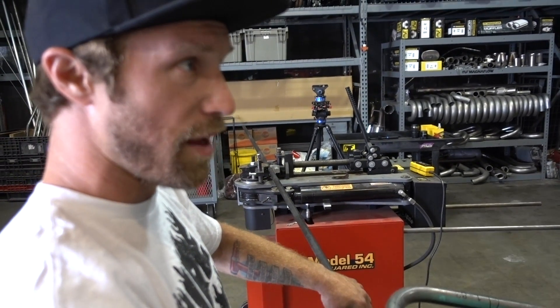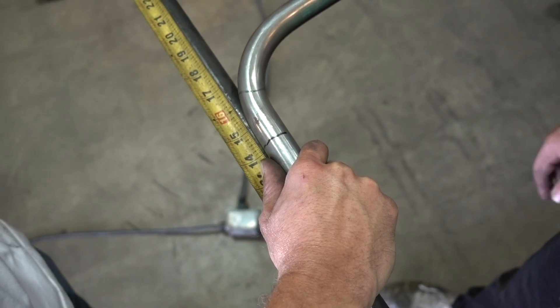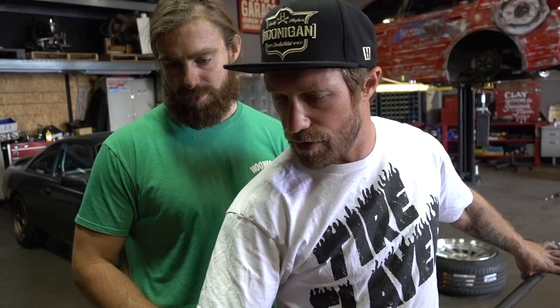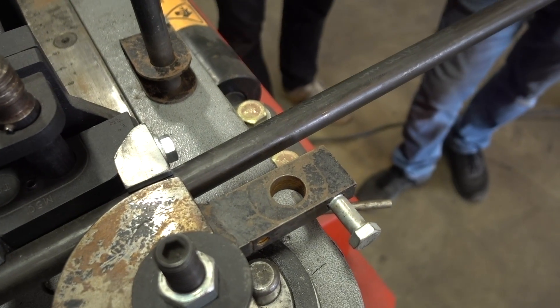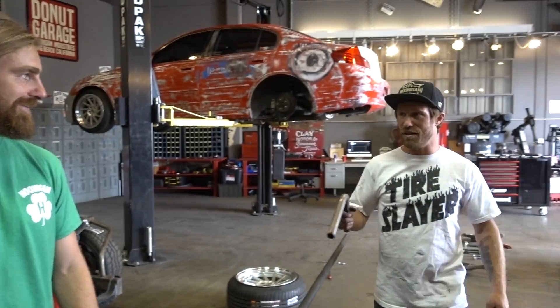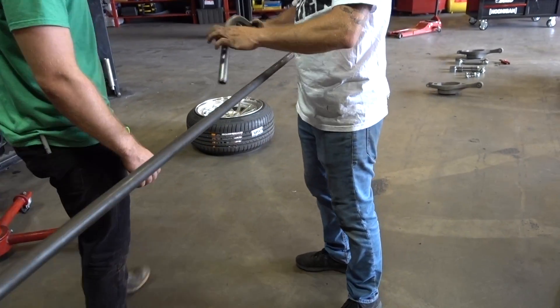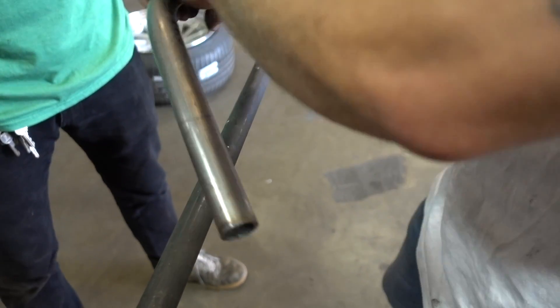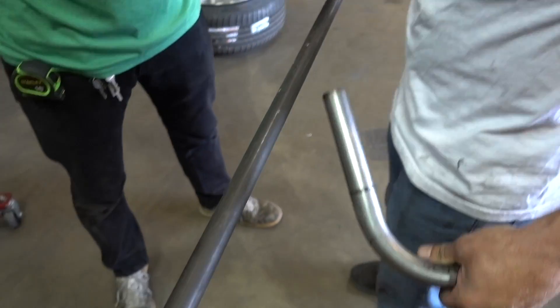That's why I always bend these and put a mark where the bend is so I can visually see it, because sometimes it just hurts your head to do all the math. So we'll start at fourteen, and from there we'll judge the other side. So you use this as your line — when you want your fourteen inches, start right here. But you've got to make sure you're bending it from the right side too, because if you bend it fourteen inches from that direction it's going to bend differently. This is where the bend starts and it pulls it through like that — that's where you want to be on your ninety. If you shoved this through here and measured fourteen inches there, it's going to bend it really short. I'll just show you when you're done with this first one.